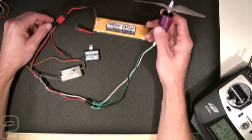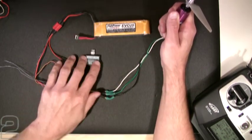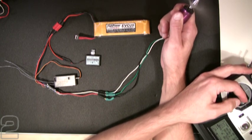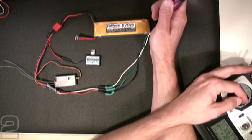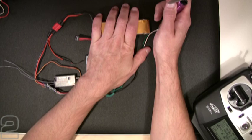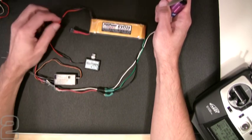This is a complete power plant. One benefit of having a low battery voltage indicator: when the motor starts to rotate, that back EMF surge comes through as a heavy draw, and you'll see this LX21 flash. When I put it under load and run it up, you'll see the battery indicator glow very bright — be careful with props on your bench, they're very dangerous. The light goes off as soon as we back the throttle off because our draw allows the battery to maintain 11.1 volts. It's very bright and intense, and it can save you money in model damage — especially flying a helicopter where the cutoff isn't there and you can drain lipos below minimum voltage very quickly.